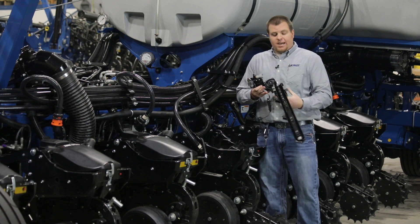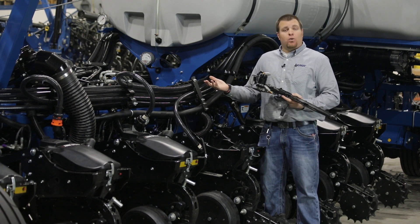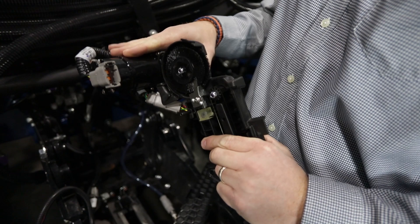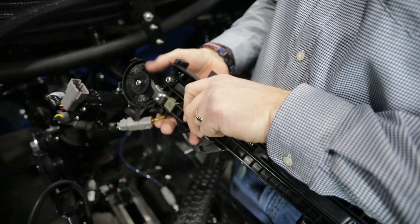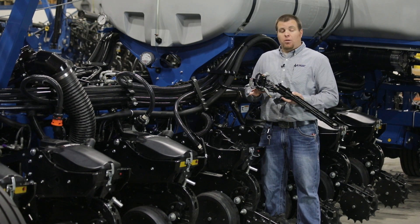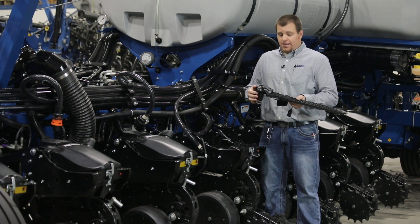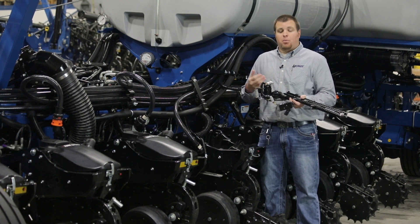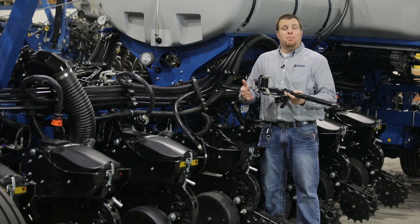Built for the long haul. As we look at electrical connections, what is driving these meters: it's still a 24-volt system like we used on all of our previous electric drive equipped planters. The unique part is we've gone to a 24-volt brushless style motor — like the brushless power tools you're used to in your shop. It's the same motor in the delivery tube as in the meter itself, so all the parts are the same. They are interchangeable, as are the gearboxes that drive the meter and delivery tube. With a Phillips screwdriver you can take apart and replace any component on delivery tubes, and they are all separate — easy to replace just one instead of buying entire assemblies.